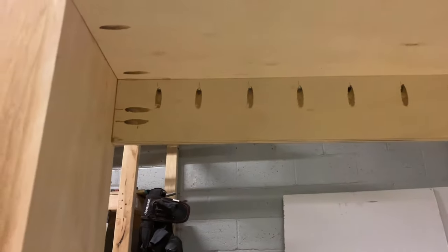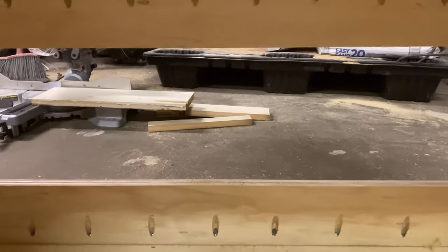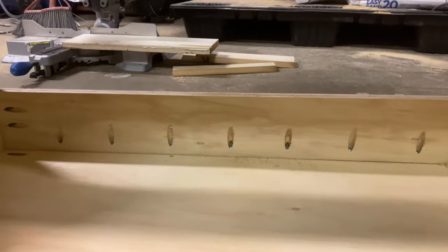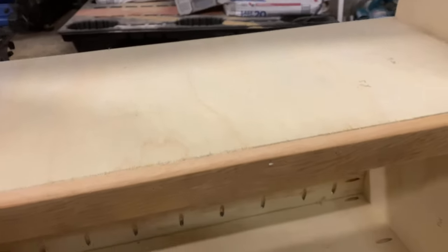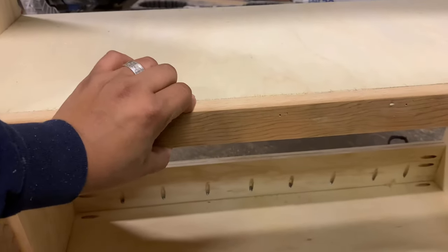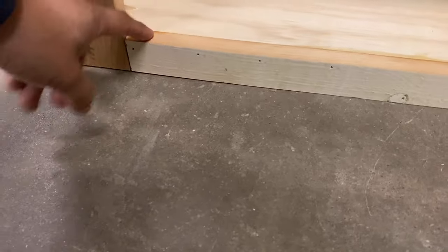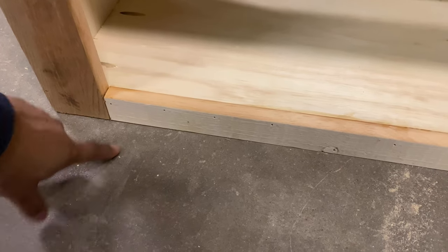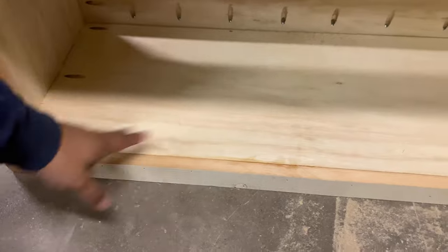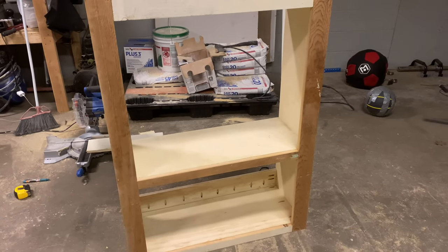The audio was rough on this clip, but pretty much we have the pocket holes — those were the little one-by-four strips. In hindsight I probably should have flipped those backwards so they'd be on the back and you wouldn't see them, same with the top and bottom pieces. I didn't think about this until I made the second cabinet box, but you should build it so the pocket holes are on the outside and on the back — that way you can't see them and don't have to fill them. Here I'll just have to put wood plugs, cut them down, sand them, and fill with wood filler.